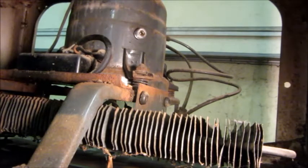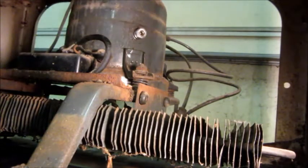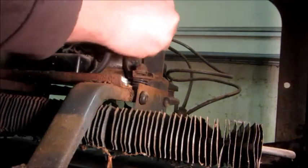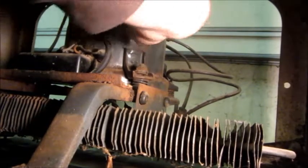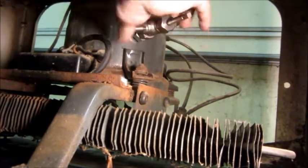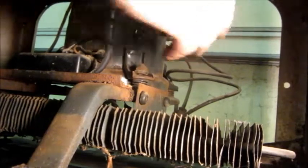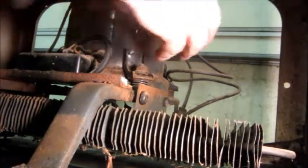Now I can purge it out with some nitrogen. Before I put the tool on there I'm going to clean it out with some brake cleaner — I don't want any debris from that wire brush going in. Now I have the kit assembled: the Bristol key goes inside there and the valve body fits over all that. I'll get it tightened down. Once this is on there my gauges can hook up easily. With that valve body in place the hand wheel can go on — when I turn that hand wheel I'm turning the plug inside the compressor. I'll give this packing a little tension so the stem won't leak.